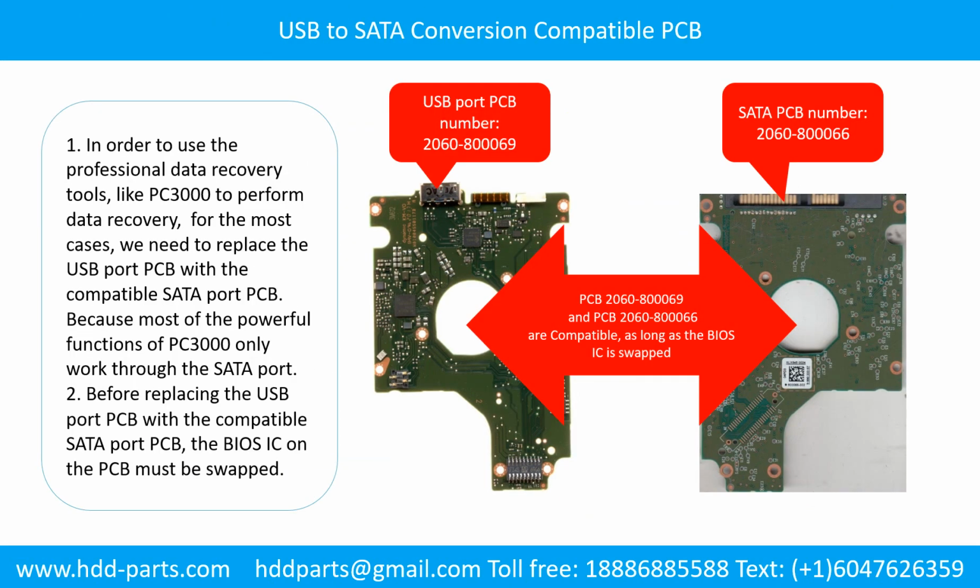USB to SATA conversion compatible PCB. 1. In order to use professional data recovery tools like PC3000 to perform data recovery, for most cases we need to replace the USB port PCB with the compatible SATA port PCB, because most of the powerful functions of PC3000 only work through the SATA port.